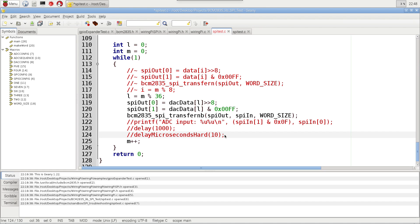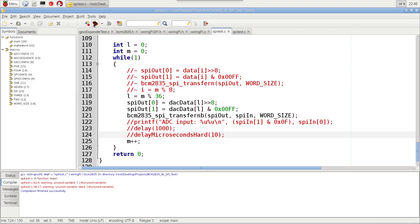When we run this, it should output a sine wave on pin 6, at the maximum performance of the device at our clock frequency. Let's go ahead and compile and build. I get a few warnings about unused variables, but it compiles successfully — it's just code I'm not using anymore. It should run just fine. I'm going to switch the camera to show the oscilloscope so you can see what this does when it runs.